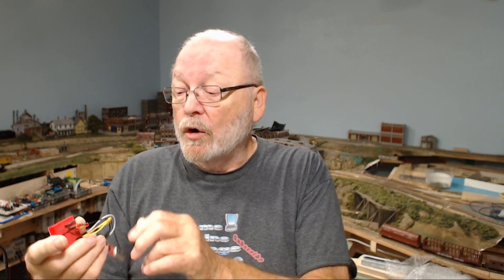The ATtiny chip — can it be programmed over and over again? Yes it can. I have a couple of them here that I was experimenting with. You can program them repeatedly as long as you do it the way I showed in the video. You can use the little programmer — here's the one I have from SparkFun — or you could use an Arduino Uno or any Arduino using it as an ISP.